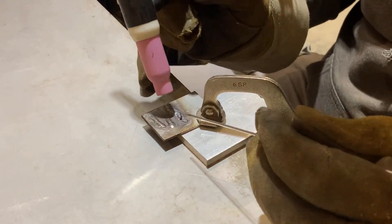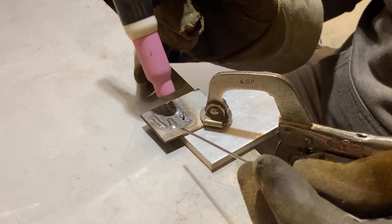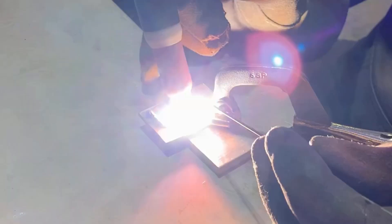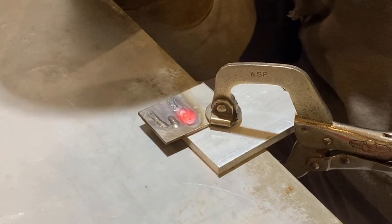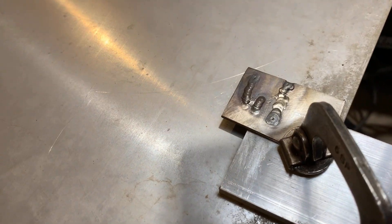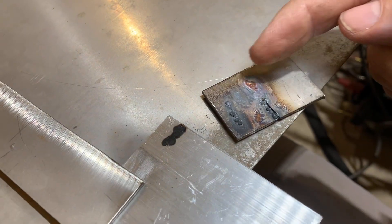That kind of felt all right — it doesn't look very good, but it's welded. Looking at the other side: burn through. I'm going to try throwing a backer plate of aluminum on here and see what we get with that. I need two clamps to do this — or I just need to think about it a little more and clamp it a different way. Let's see if we can get from here to there without destroying everything. That looks better-ish — needs more work for sure. But with the aluminum on the back it shouldn't have blown through. Here's the back side of that weld — a little bit better, definitely the cleanest so far.